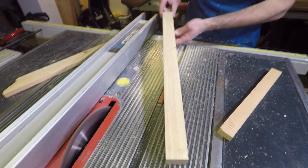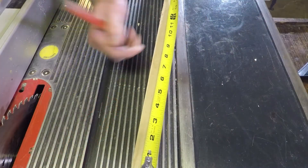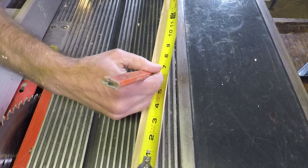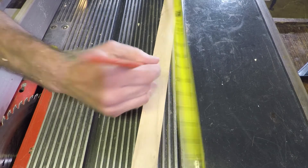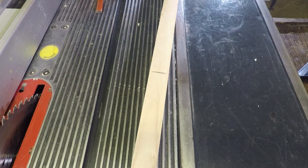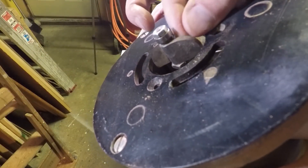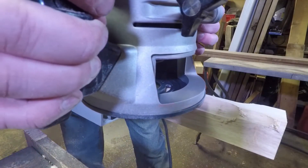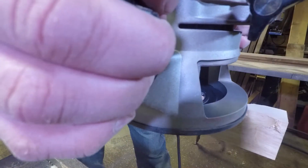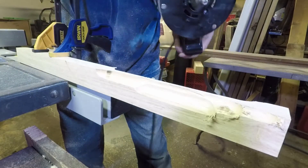All I know is that it's going to be a piece of wood with a bunch of magnets in it and it should be somewhat ergonomic. The final dimensions end up being one and a half inches tall by one and five-sixteenths wide by six and one-eighth inches long. I'm using this round router bit to shape a groove into the top side of the soon-to-be stud finder. I haven't cut it down to length yet, but this way I can clamp it down while I shape the wood.